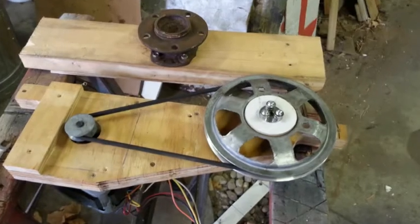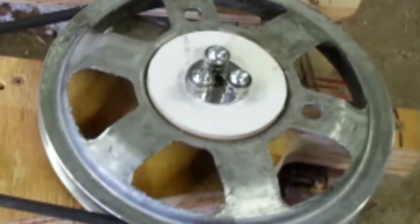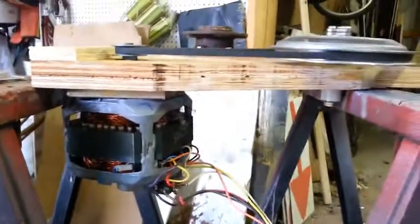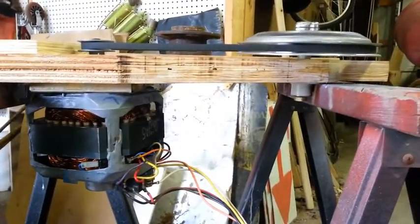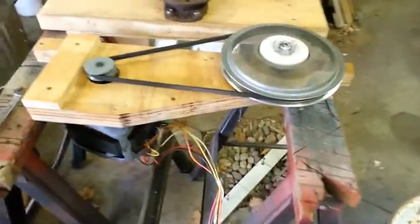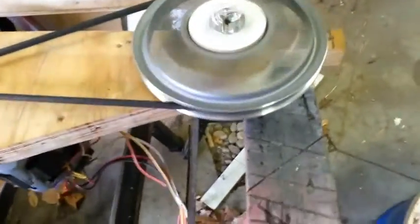Here's the base frame with a car wheel bearing and a Maytag washing machine motor. The motor has a two inch pulley, which is not original. The eight and a half inch pulley is the Maytag agitate and spin cycle drive pulley, which I mounted on a jack shaft made from a bolt going through a wheel assembly I got at Tractor Supply. The three tooth lantern gear is right on top of that pulley.